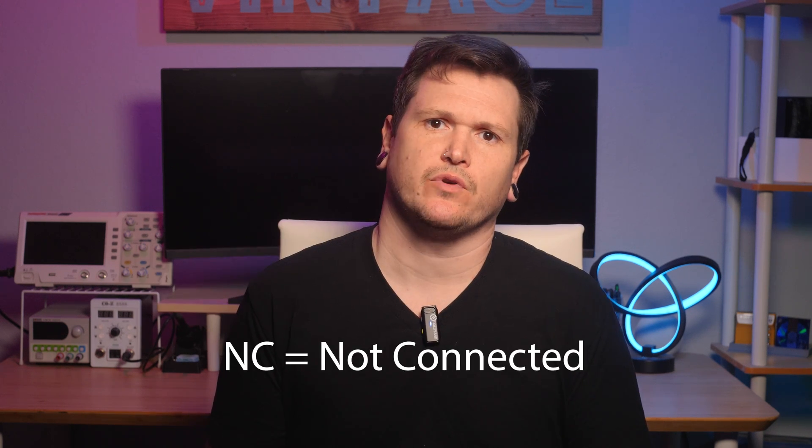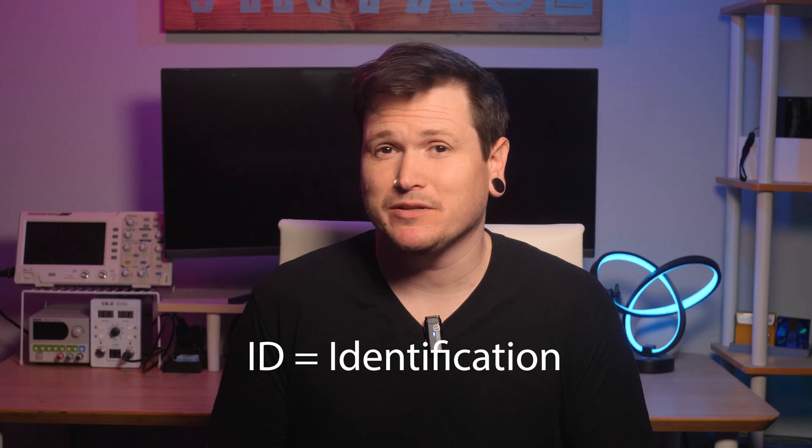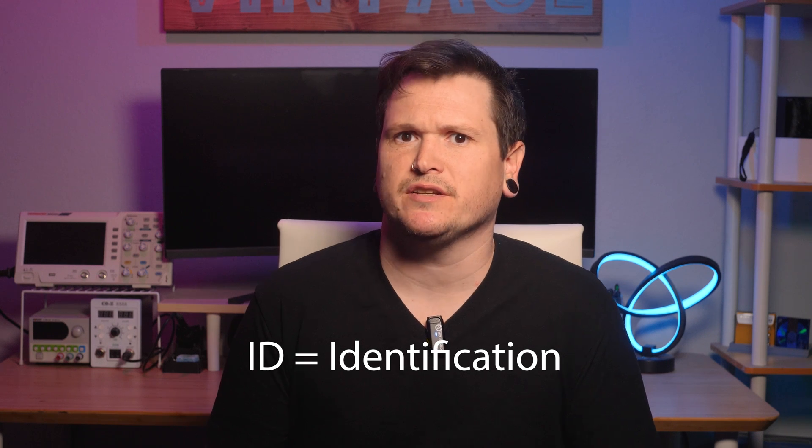NC stands for Not Connected, and as far as I can tell, this has never been in use. And finally, there is ID, which I think probably stands for Identification. I wasn't able to determine its purpose and it doesn't seem to do anything except present a constant resistance. Leaving it disconnected has not affected functionality. Now, if we wanted to replicate the original battery pack, we would need to connect a thermistor to the RT2 pin. But that thermistor would have to exactly match the characteristics of the original. Some testing showed that the Kindle does not work properly without the thermistor connected — it will come on for a little while, then turn itself off. That's presumably a safety measure because it is seeing an infinite resistance instead of a resistance that corresponds to a safe temperature.